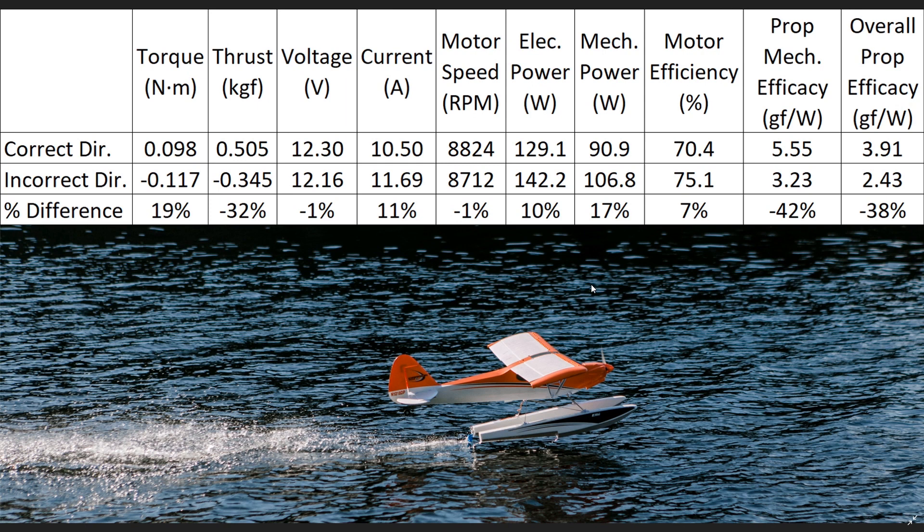So is it really beneficial to take a tractor-style propeller meant to pull the plane and use it as a pusher prop operating in the incorrect direction? We're losing about 38% of the gram-force thrust value at the same wattage — that's quite a drop, and it really does make you question whether it's a good idea, because you'd have to put in a lot more watts to get the same thrust. As always, like the video if you do, and don't forget to hit that subscribe button so I can see you in the next one. Thanks a lot for watching!